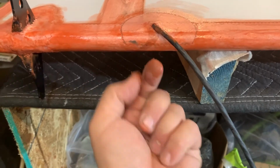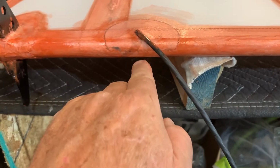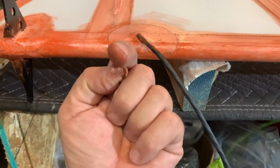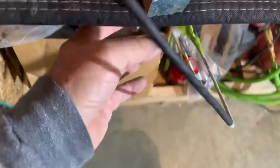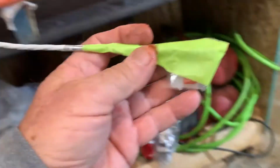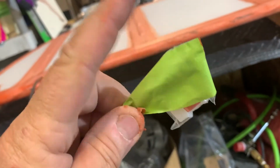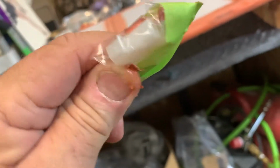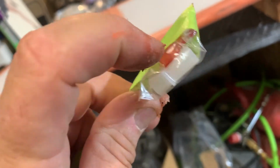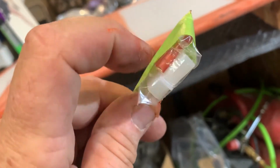There's some tubes coming up. You'll just burn a hole there. It'll come around your fuselage. The back of your fuselage will be here. It'll wrap in between, and then it'll go into that hole, and then you'll connect the wires there. So the wire pieces are somewhere here, and oh, here they are. So you see, it'll come with a connector. This end of the wire has the female or the male pin connectors already on it, and they should have given you the housing, and there's a bare ground wire there that you'll connect with the wiring harness in the fuselage. That little piece should be there.